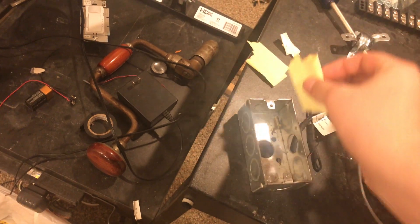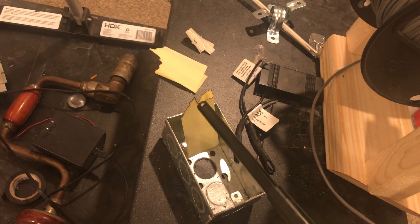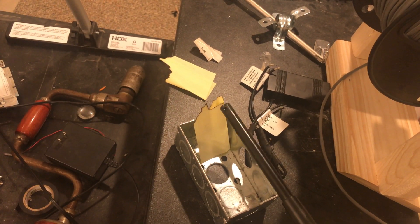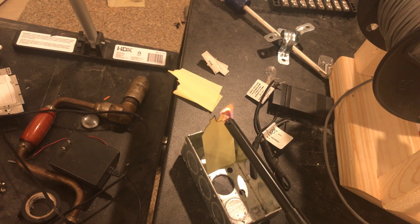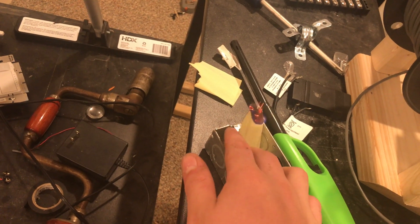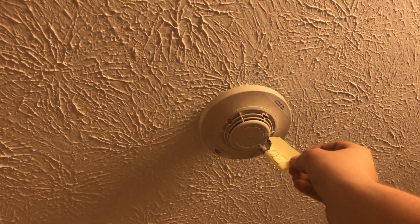Panel is resetting and we'll use paper and a lighter to do a smoke test. We grab the lighter — we've got a flame. We'll hold it up and we might get a pre-alarm warning when smoke hits a certain concentration in the detector.